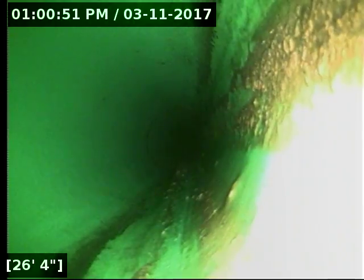Spots like this where I'm peeling it off the bottom of the pipe, and it looks like it's probably a little bit of toilet paper too. I do recommend jetting the line out. The line is functioning, but that stuff can cause debris to hang up on top of it. It doesn't mean you're going to just get a backup all of a sudden, but it would be a good idea to get it cleaned out of there and then avoid putting grease back down the line.